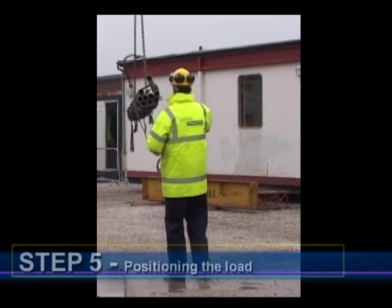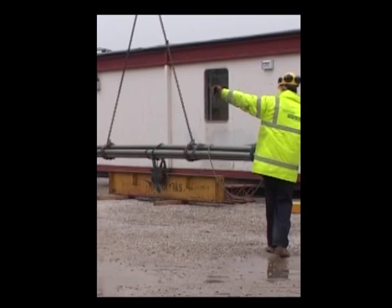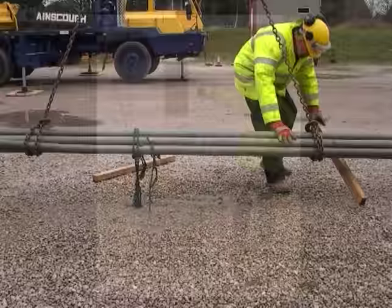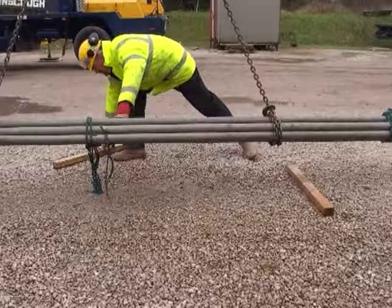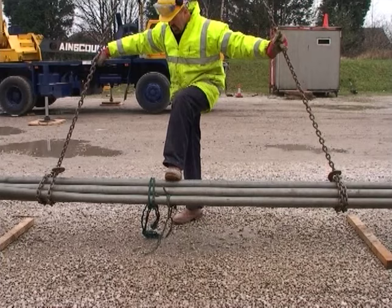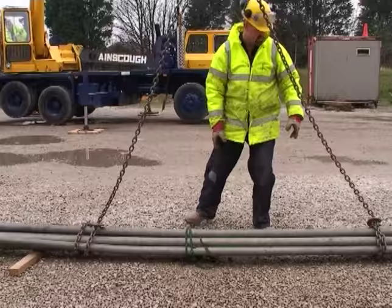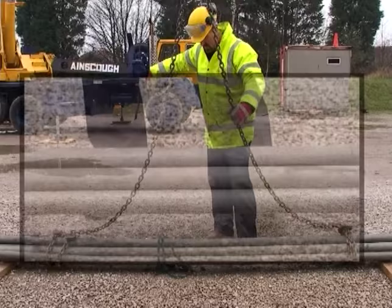Step 5: Setting the load down. Now you have positioned the load where you want it to be, you are ready to lower. This is where the tag line will be helpful. Check that the area is clear of obstructions and the ground is suitable to accept the weight of the load, and that all unauthorised persons are clear. Check that the load can be properly supported by using suitable supports. Lower the load until it's just clear of the ground and stop, then indicate to the crane operator to lower the load slowly until the load is secure and stable. Remember, the slinger must exercise care when lowering the load — it's surprising how many slingers trap their own feet.